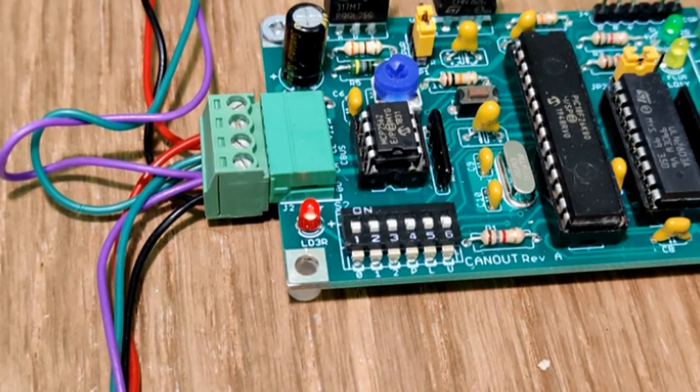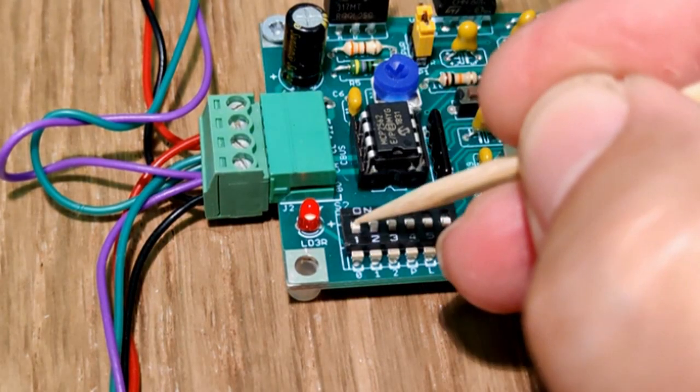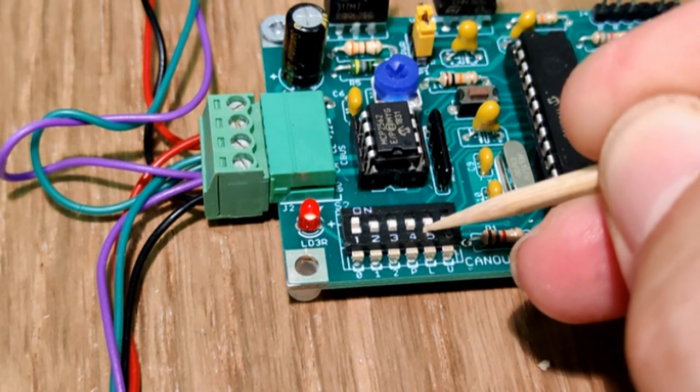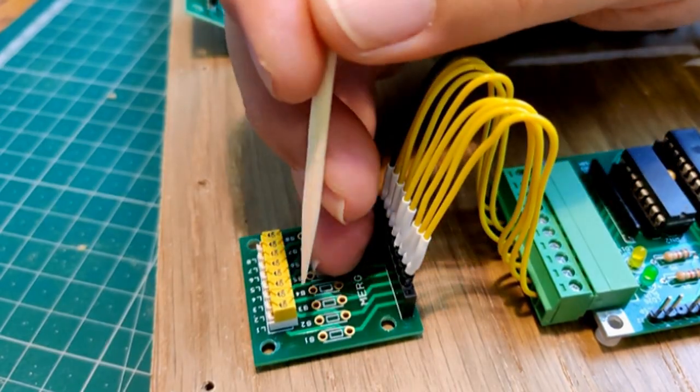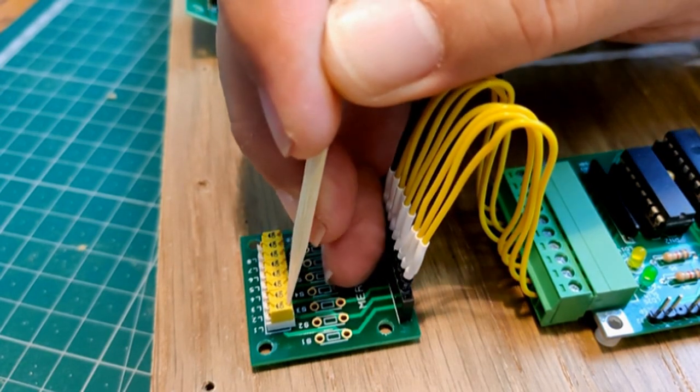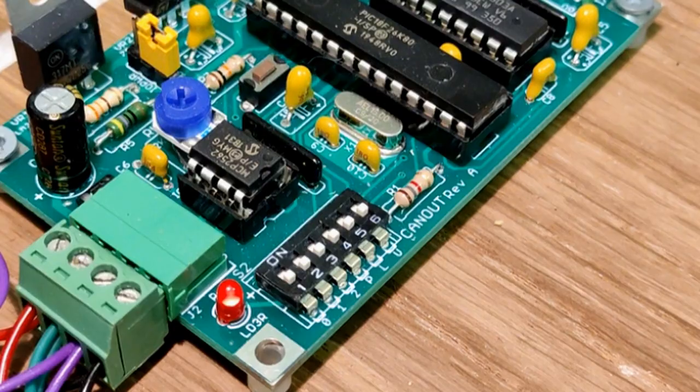I also want input number 1 to switch on LED 7, so I configure this in the same way. Output number 7 is selected on the selection switches, Learn is set, and input switch 1 is turned on. Then the configuration switch is turned off again.